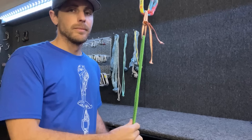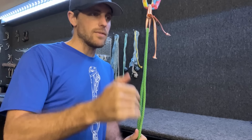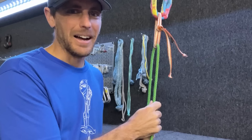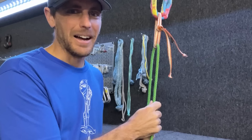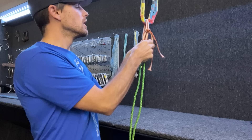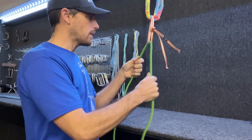I don't want to give the impression that this is safe just because it got 18 kilonewtons and you're only putting one or two on it — that is in one test. If you repeatedly do that it could be a problem, and you don't know what you don't know. The other risk is when you have soft things moving on soft things — they cut through each other. I'm going to try to demonstrate how quickly that happens. I'm reusing the sling here with the knot, and I do see some abrasion from the part that was touching the hanger, but right where I have the rope it is not too bad.